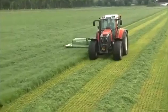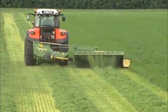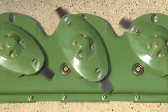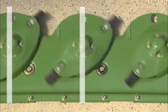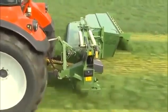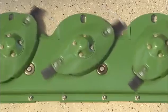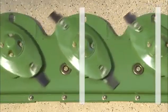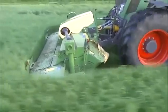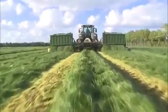The new easy-cut mowers with the smart-cut cutter bar deliver the best results in heavy and light crops. The smart-cut technology is based on a strategic arrangement of the discs. Those discs that turn outwards are spaced closer together, so their blades overlap more for the cleanest cuts in light crops. Those discs that turn towards each other are spaced further apart, creating a larger gap that allows them to cut large volumes of crop quickly and smoothly. This smart-cut technology minimizes the risk of blockages and boosts productivity.